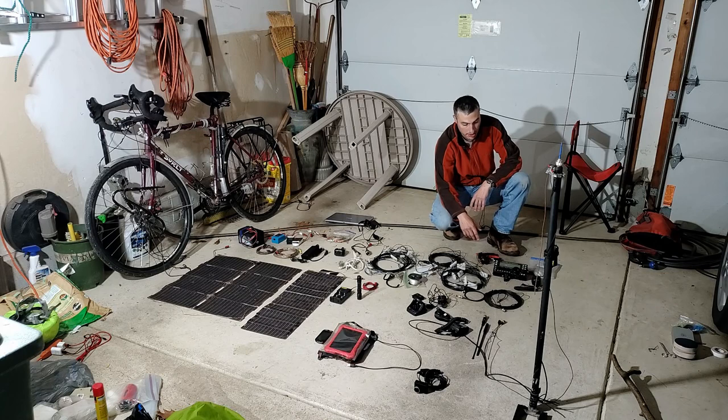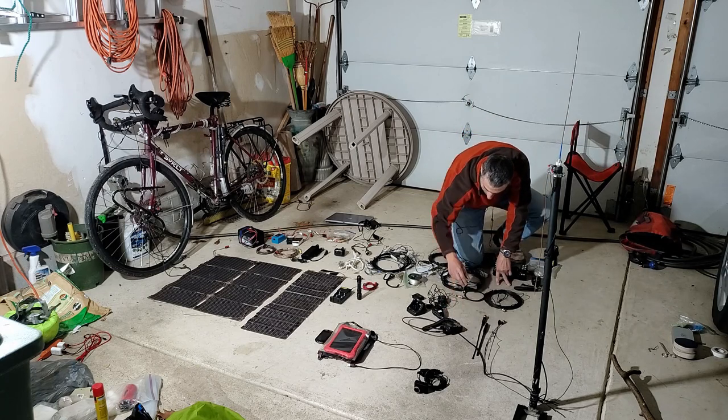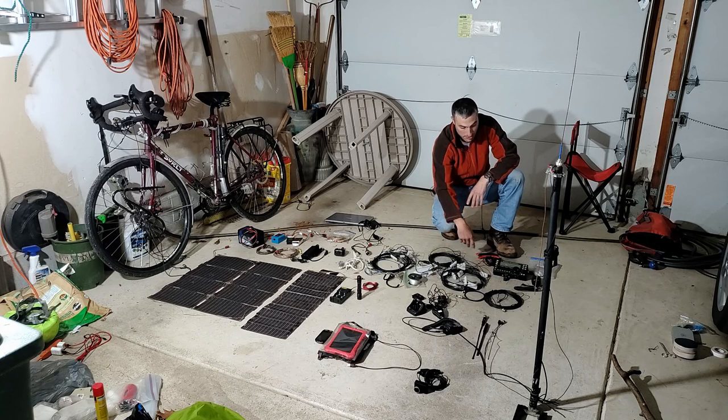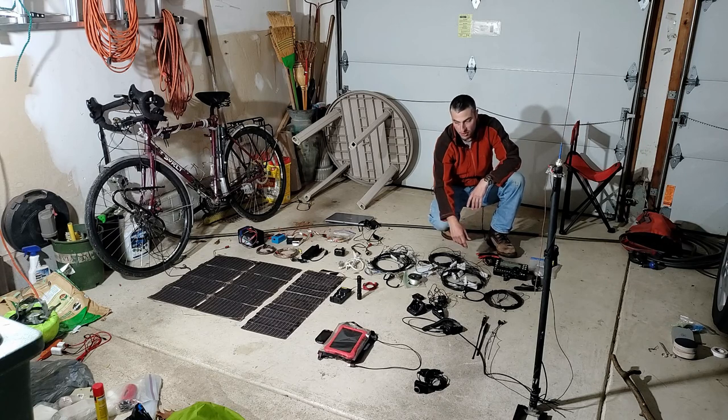There was a time early on, maybe 4 or 6 days into the trip, I took a day off, and I had the antenna set up and was running 40 meters with some guys back home, and I was running 3 watts and getting back no problem. So I even dropped it down to 1 watt just to experiment. And just for a comparison of power, a typical handheld like this one here on 2 meters and 70 centimeters will do 5 watts. So you look at the power of a handheld, and then you look at this radio running HF at even just 1 watt, I was talking several hundred miles, just as clear as day. So it goes to show you the power of shortwave, and also what propagation conditions can do.